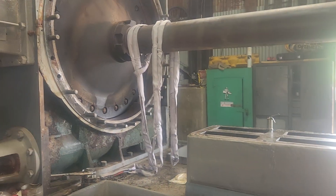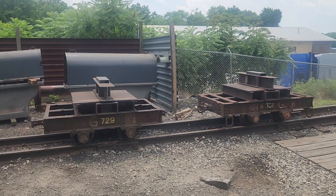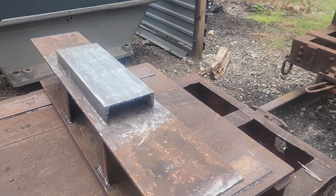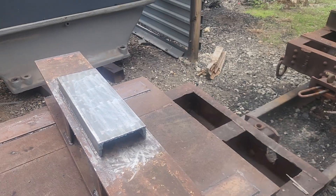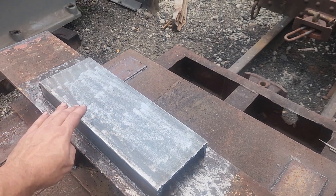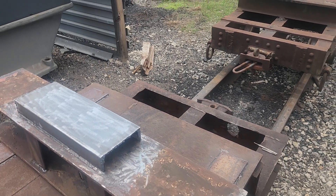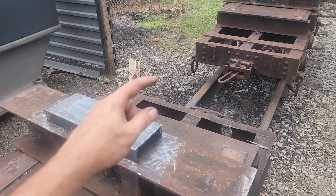The low-pressure cylinder is ready to go. I've got the new slings here ready for it — we'll pick it up, set it on a transfer cart, roll it out, pick it up with the forklift, and set it on these two cars. We just got done fabbing these up yesterday — basically these are movable bolsters. When we set the piston rod down on it, we'll push two pieces of angle up against it, weld them in place to create a cradle, add a thick piece of rubber belting as a cushion, and strap it in place.